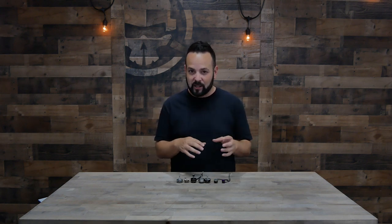For a 4-inch prop, you'd want something like a 1806 to 2204 motor. For 5-inch propellers, roughly 2205 to 2308 — there's quite a bit of range in 5-inch since it's the most common prop size with the most variations. For 6-inch, you could go as low as a 2206 up to maybe a 2408. That gives you a general idea of how prop size maps to motor size.